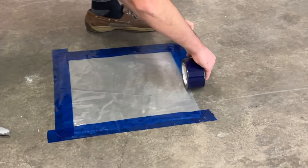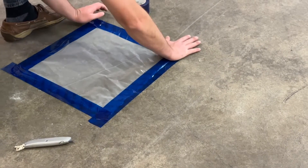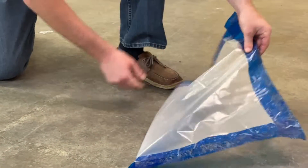Are there any other methods to evaluate? There is another method — it isn't as quantitative, but it does give you quality. It's a test that people ran a long time ago and there are still some cases where it's being used: the plastic sheet test, ASTM D4263 — Indicating Moisture in Concrete by the Plastic Sheet Method. Basically, you go out and take a four-mil plastic sheet, 18 by 18 — or I like 24 by 24 for a little bigger area. You tape it down, make sure you pull the plastic through so you don't get any air caught underneath it, and let it sit for 24 hours. Pull it back and see if you've got any moisture. If you've got moisture drive coming through, it's a quick way to see it. It's not quantitative — I can't give you a number — but it lets me know what's coming through. You either have a moisture problem or you don't. As a test man, I would let it sit 72 hours, which is where the other tests are sitting at between 60 and 72 hours.